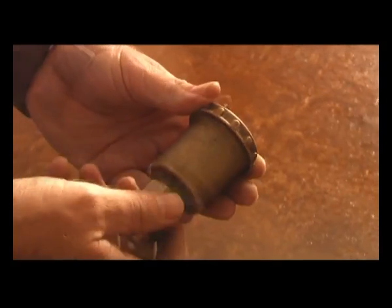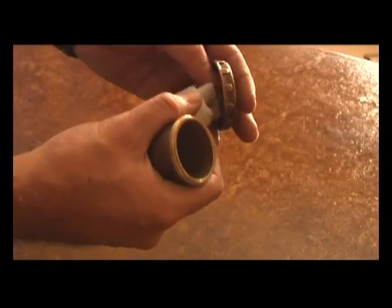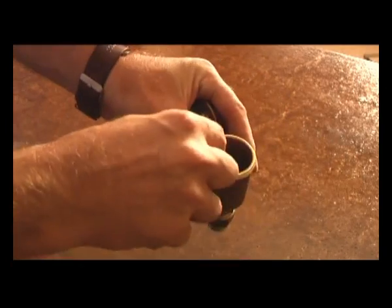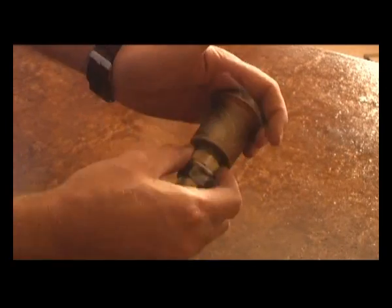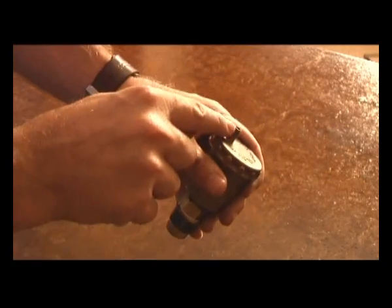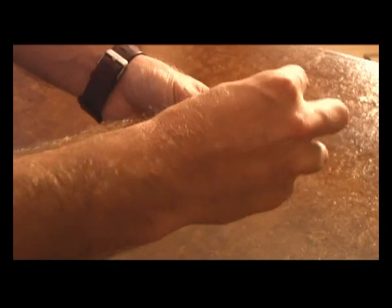This is an air relief valve. What it does is let air out without losing water out of the system, similar to a float valve in your toilet system. The float is lighter than water but heavier than air. The air from the system accumulates inside the little reservoir, and when there's enough air in it, it releases the air at the top. When the mains pressure comes up, it shuts the valve off.